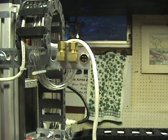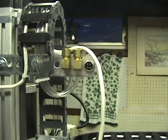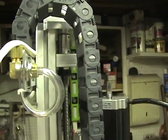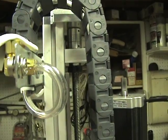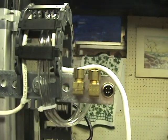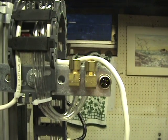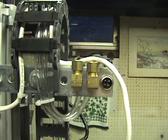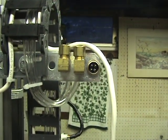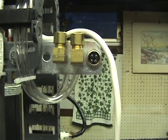I'm looking at some quick disconnects that are designed for liquids — I'll see if I can get a hold of a couple of those. But for now, what I've actually done was gotten some brass compression fittings and I have the lines run in here and mounted. Then I can just run the hose lines up to the top of these fittings and attach them. I can just undo them, put a cap on them, and then remove the spindle. I've also got a four-wire connector that I'm going to use for plugging in the power for the spindle.